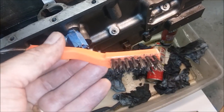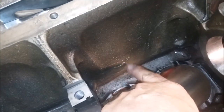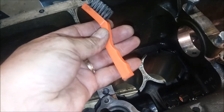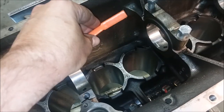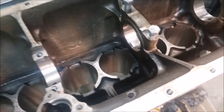A couple of brushes were really helpful. One is a big brush on an extension — Clutch item 42280 — used with a drill extension. Another very helpful one for getting way up in tight spots is a mini stainless steel wire brush set used on a Dremel tool, Clutch item 43258. I also found a welding slag brush very useful; it's stiffer and works well on interior surfaces, though I had to cut the handle down to fit.